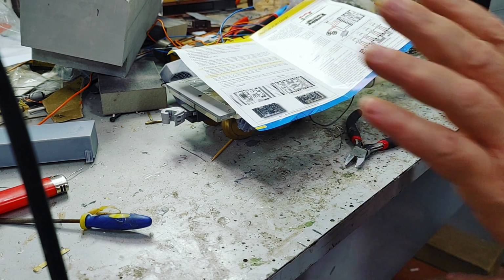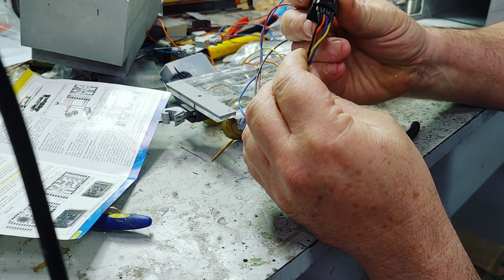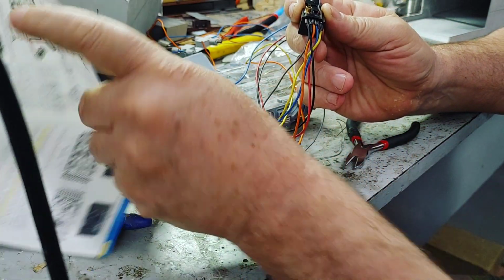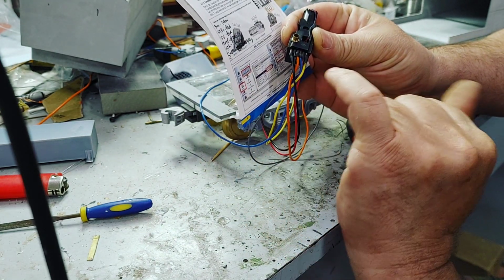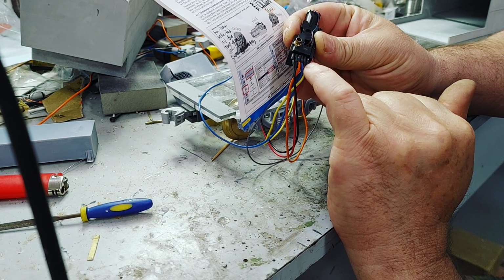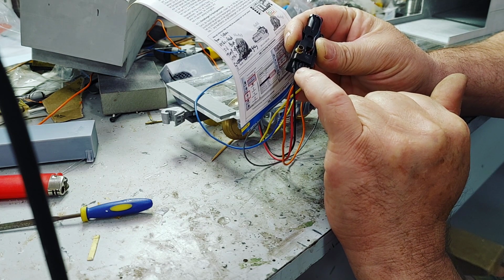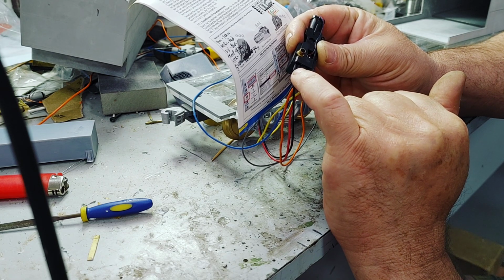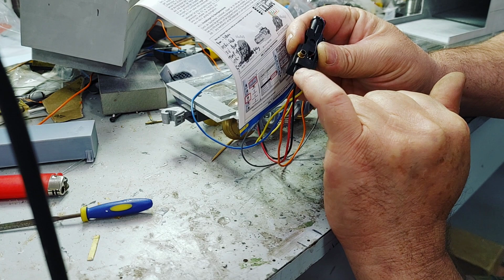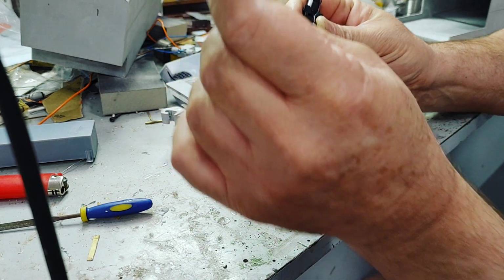I'm busy doing the smoker for that wagon that I spoke to you about yesterday. And these are the wires on it. Now, if you look here, it starts from this side. It's the fan, the heater element, 5-volt input, the temperature after the heater, temperature control for when it gets too hot, it cuts off here, and then ground.